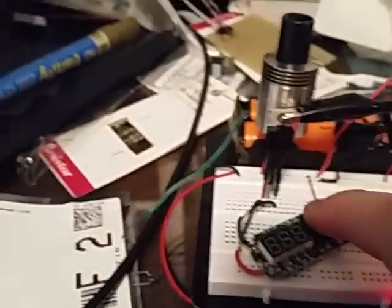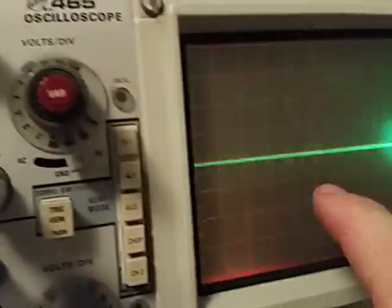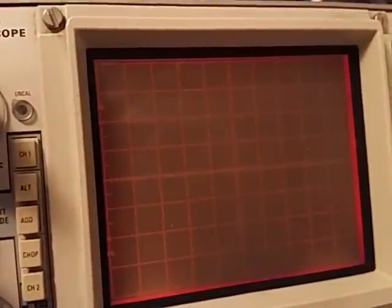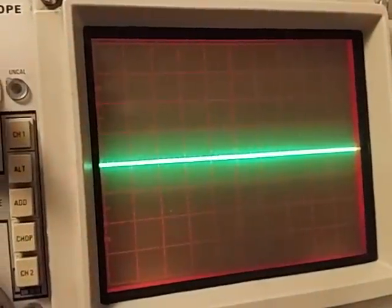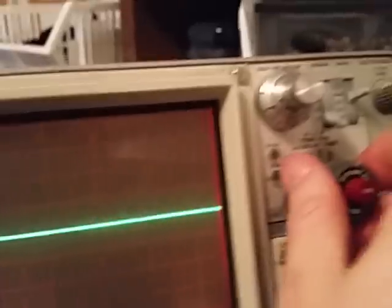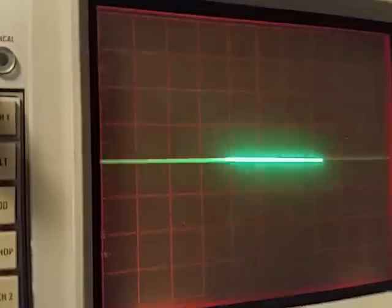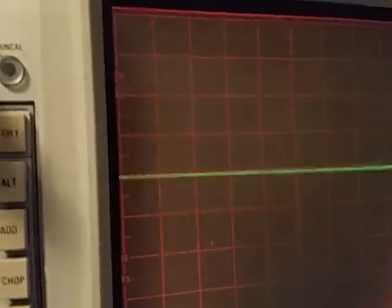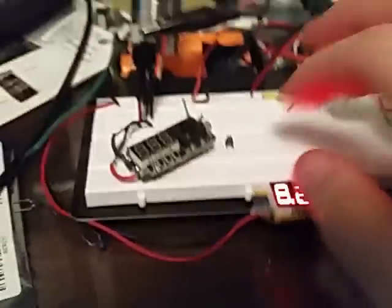This will work. Now let's see where our voltage is. I'm going to teach you how to read an oscilloscope — five volts per division. A division is one of these illuminated lines. So each one of these lines is a division. Five volts per division — let's count them. We have five, and then in between so 7.5 roughly, in between the next one. So it goes from zero to 7.5.